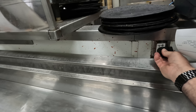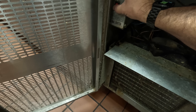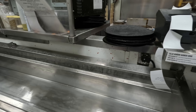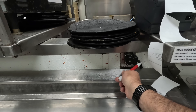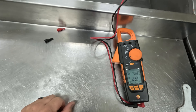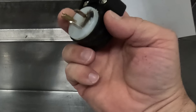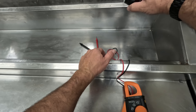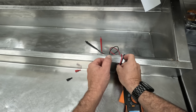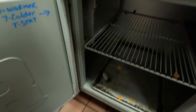Let's plug it in and see what happens. I plugged it in just a little bit ago and nothing happened — nothing's still happening. I'm not hearing anything clicking. It says we've got power there. We have 122 volts and nothing is happening. So we do have power. Let's see if the evaporators are running. Your evaporators usually run non-stop on a cooler, and they're not running at all, which is kind of odd.